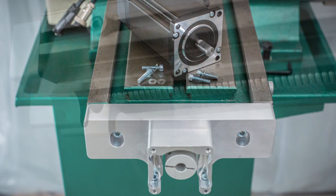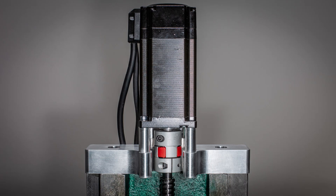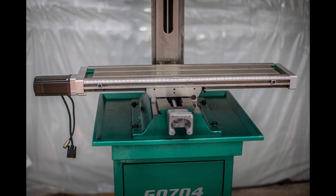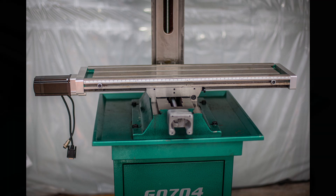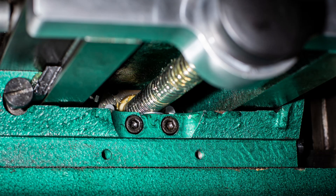I positioned the table a couple of inches right of center and then installed the motor to support the ball screw. Since the assembly is still loose in the slot, this offsets the weight of the motor and keeps the ball screw resting on the two shim washers. I checked the right ball screw bracket to make sure it's not lifting up, and verified that the ball screw is still resting on the washer.